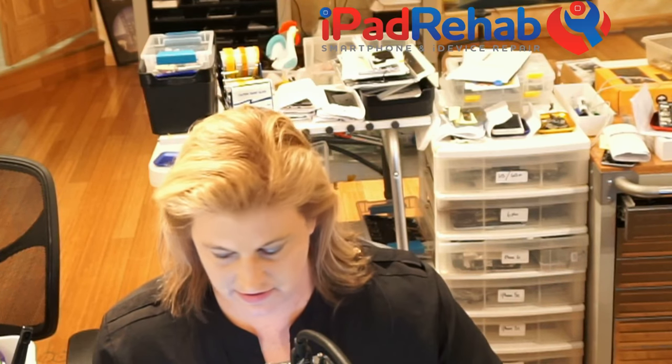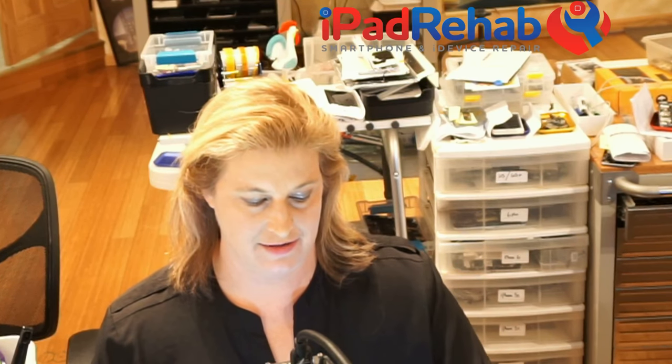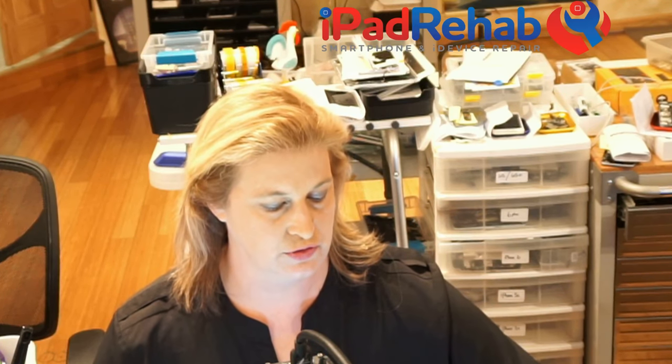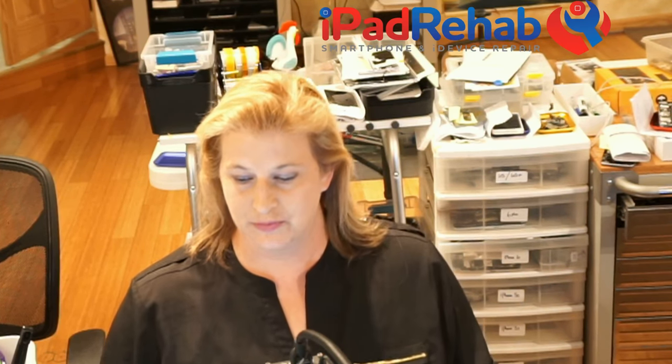All right, I'm going to take apart this 5S because I am going to go on a hunt to see if we can probe around a little bit and figure out what the secrets of TriStar are. One of the things that I notice a lot with questions and comments on YouTube is that people still call the TriStar chip the U2 chip, and that comes from way back when the iPhone 5 was the first device that really started to have TriStar problems, and the TriStar chip was in the U2 position in the iPhone 5.